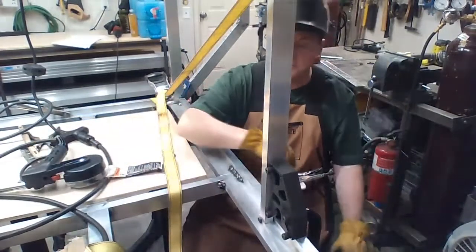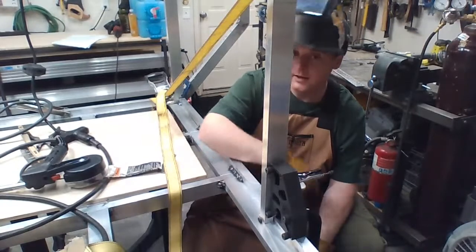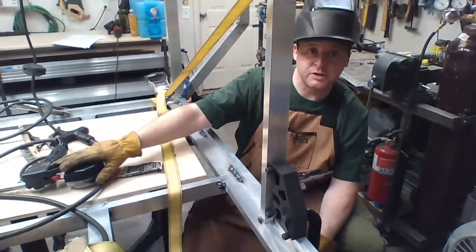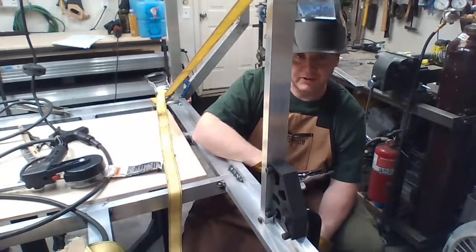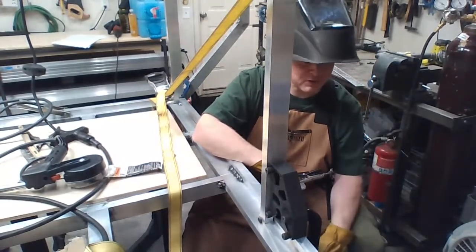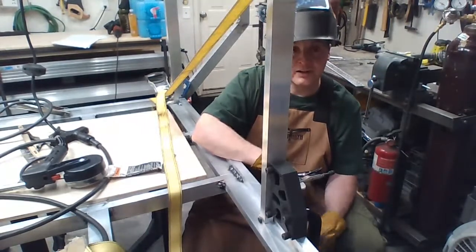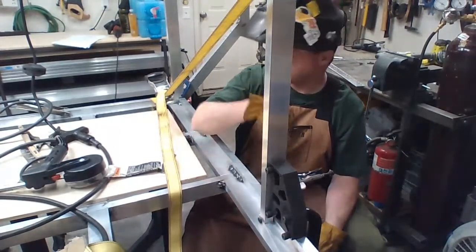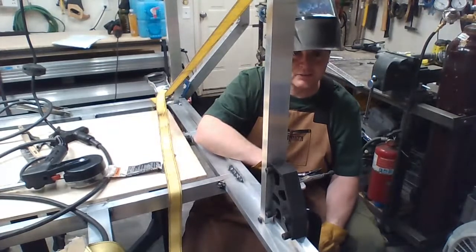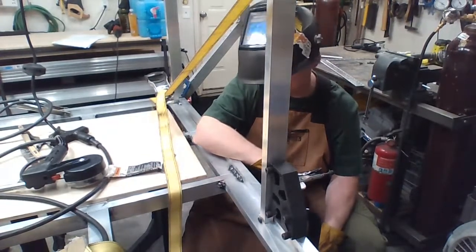Okay. So I had some welding issues earlier. I found I actually tightened the spool cover too tight, and it was actually just causing the thing to drag, which is awesome because I kept setting the spindle speed, wire feed speed higher and higher and higher. I'm like, why aren't you feeding? And eventually got so tight I just jammed it to see it spin. Fixed that. Had a bad ground. I didn't clean it up at all, so it was going for constant layer. Now it seems to be doing great.